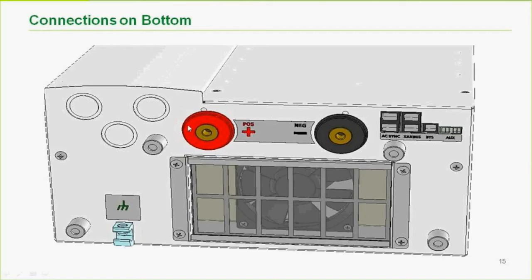So I just got a comment that the battery cable bolts could be a little bit longer. I haven't actually hooked one up, but generally speaking, there should be only the flag terminal from your battery cables going to this. I used to work in repair back at the Trace days, and one of the things that often installers would do is put nuts or even washers between. The old inverters had a post, not a hole like we have here, and we used to call it double nutting. If you were to put washers in between the battery cable and this post, this terminal, you would actually get voltage drop across there. So you should have the battery cable flush onto this with nothing in between it, then the bolt with its washer, which I would guess is going to be a lock washer, but I don't know that.